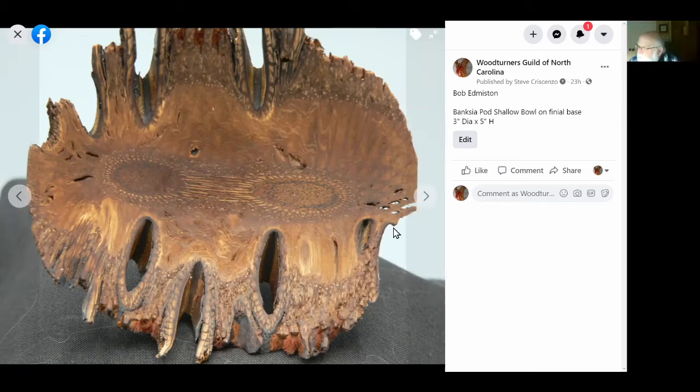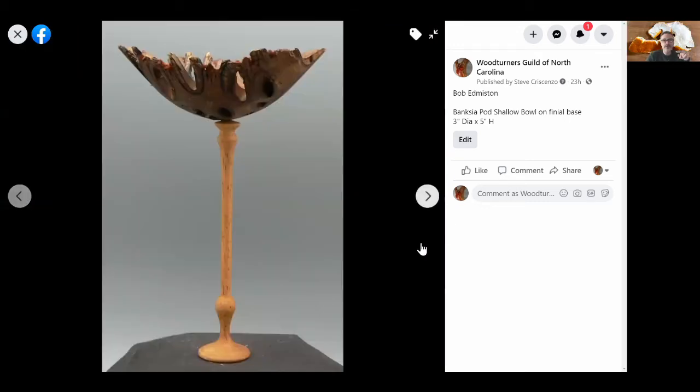Yeah, it's amazing how hard these things are. When I'm doing it, I use like a 3/8 inch bowl gouge, or more of a detail gouge, and man, I sharpened that thing probably 2 or 3 times doing this. Right. Bob, one thing on the stem problem, can you go back a sec? I had a similar problem in doing that 3-tier stand. There was always going to be some kind of cruft at that center point near the threads. Right. A cove makes everything hideable.